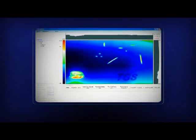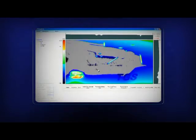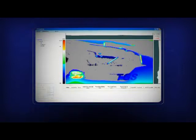Considering that the pipes are normally subject to deformation as a result of the manufacturing process itself, the surface should be corrected in order to obtain a reliable reference. This is obtained by identifying with the cursor the defect-free surface. By clicking with the mouse, the tone of such surface will turn gray. As soon as correction is completed, the deformation-free surface is obtained. A reliable reference is now available for analysis thereof.